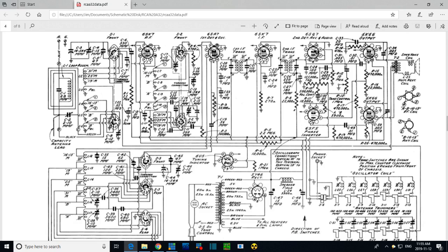How can we tell that? We can always take a test on the top here. The problem is the reading, taking the voltage reading, the meter can drain the charge out of this line between these two large resistors. So the meter is about 10 megohms, and these resistors are 2 megohms. So I put a voltmeter on here. What I will read is not what was really there. I will read what it is when the meter's hooked up.